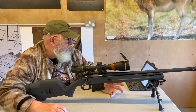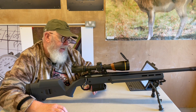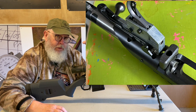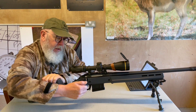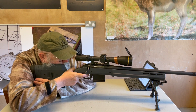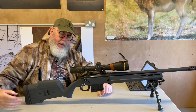The trigger is what they call the Marksman adjustable trigger, and it's easy to adjust. Basically you take the action out of the stock — the trigger sits in an aluminium block — and at the front is a little screw. Winding it in or out adjusts the weight. As this came out of the box it's probably about a three-pound break, which is good enough.